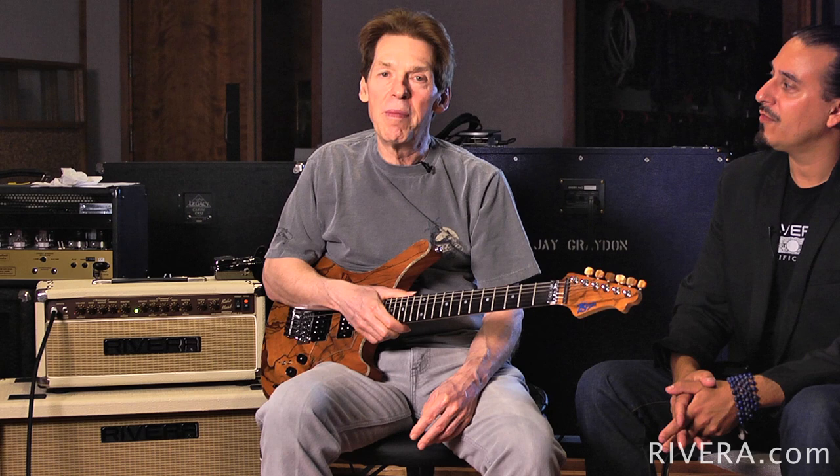There is a guitarist who used to make amps by the name of Ron Benson — he made jazz guitar amps. Dean was talking to him, and what Dean and I were always interested in was finding amps with a nice, sweet mid-range tone when playing with a rear pickup, either with distortion or without — a nice thick mid-range tone instead of a bright, thin tone. Ron Benson said there's a way to do that: you change the capacitor in the tone circuit of the amplifier.